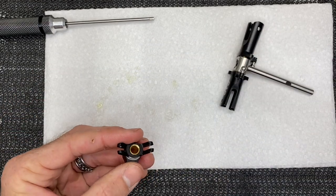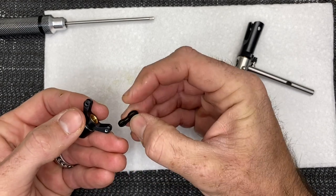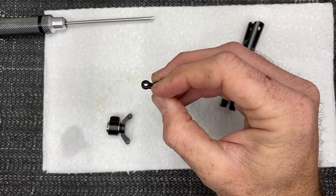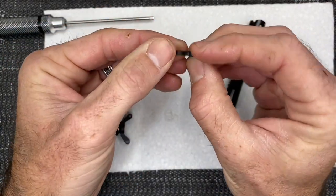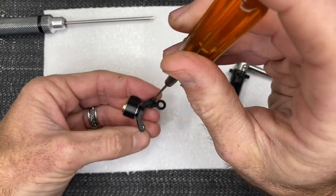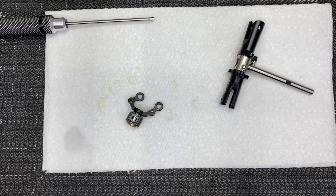The pitch slider has these little arms — it's important how they go. The S needs to face out, so you'll have one going this way and one going the other way, with screws going in opposite directions. The S goes towards the head of the screw. Grab the little black spacer — they are tiny so you'll drop it a couple of times — push it into place, making sure S is going towards the head of the screw, then slide this guy into place.